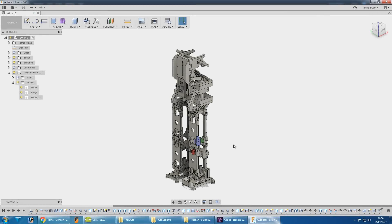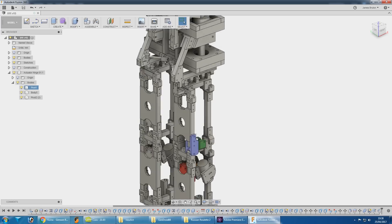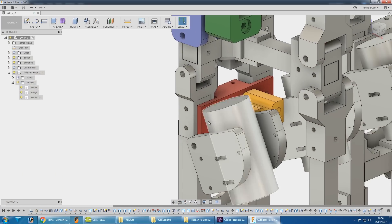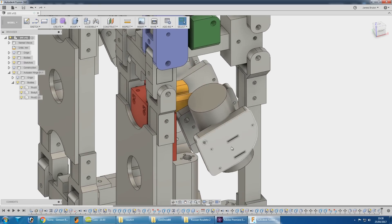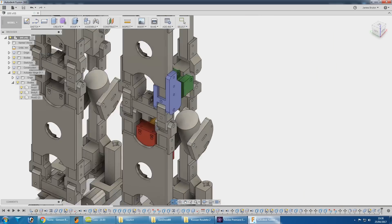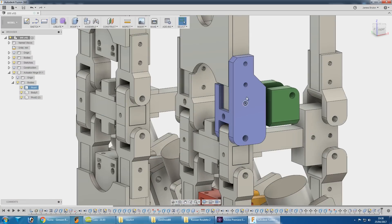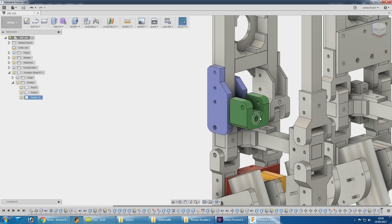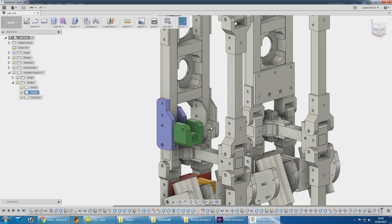So now we need to do a little bit of a redesign and make some new parts to hold those actuators. The original design for the robot was done in Autodesk 123D Design, but I've now brought that design into Fusion 360. We had the pivot points in the middle of the knee on this piece of plastic, which was bolted onto the 2020 extrusion, and the other axis for that end of the actuator are these yellow parts. Then there was another axis that attached to the actual actuators, which were 3D prints with the screwdriver motors sandwiched in between — having them in the middle meant they were quite wobbly with lots of bendy plastic. So what I've now done is designed the end caps to be slightly different, printing them in nylon which is going to be incredibly rigid, and I'm really cross-bracing them to the 2020 extrusion, much wider. The actual pivot points are wider as well, so that means I should be able to hold those much more firmly with a more rigid material.